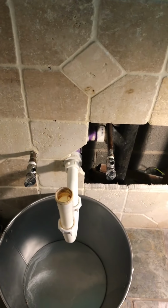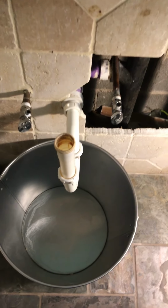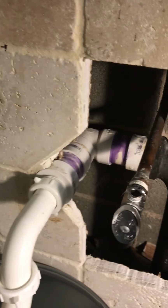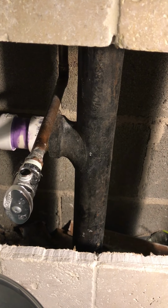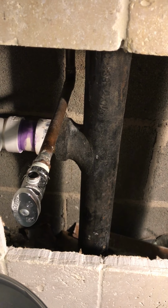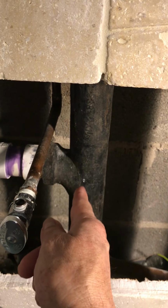I removed the furniture because I'm gonna replace it. It was too old, but as you see, now water doesn't come anymore. So I think we did a good job, and that's the way you do it. Like I said, make sure you do it many times, like 10 times. Insert the cable, let it go until it stops, and when it stops, keep it there for 5 minutes. What it does is it goes like this and cleans inside the main pipe.